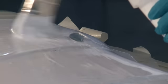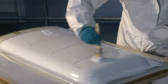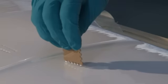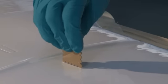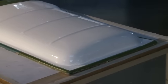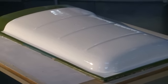Once the mould has been covered with the gel coat, use long even strokes of the brush to even out the gel coat thickness and encourage any trapped air bubbles to be released. The optimum gel coat thickness is 500 microns, although acceptable limits are 400 to 600 microns per coat. Once the gel coat has cured sufficiently, the next step is to apply the backing laminate, which should commence once the surface feels slightly tacky and within 5 hours.